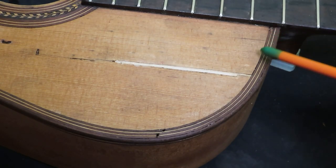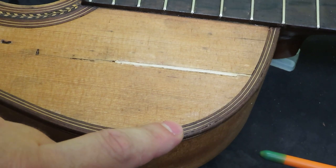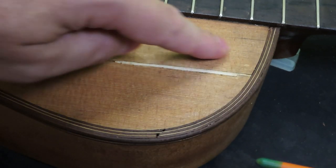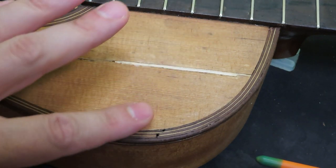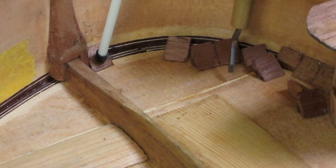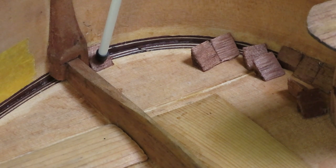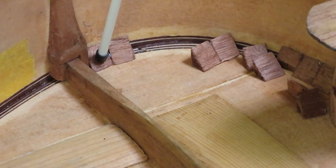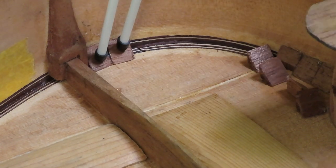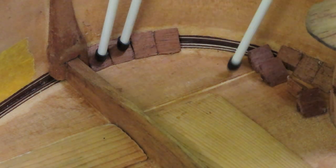Alright, so the binding is in place again, and the insert as well is nice and flush. There are a lot of aesthetics to be done, but the structure now is correct, and the soft curve that is in here matches perfectly the other side. So let's go elsewhere. This is the right shoulder. This is the insert that I just remade. Feeling like I'm going somewhere because I'm regluing the parts of the kerfing that I removed to place the binding. And this job is looking nice and simple, but I'm not going to say it too loud. Have to say, this feels incredibly rewarding.